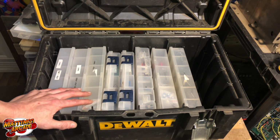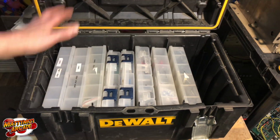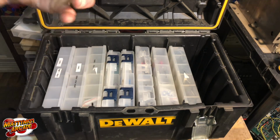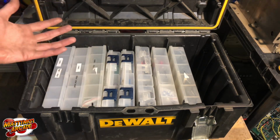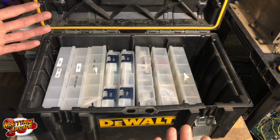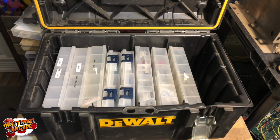All these boards have been like, oh, I don't know, or I wonder. There's no more wondering, really. I have almost everything I need to test everything within an arcade game some way or another. And if I don't have anything to test something individually, like RAM, I have a way around: we can put it in another board that works and fire the board up. Even if it's deductive reasoning, this works and this works. Those two working means that the thing next in line has to work, or it's at least getting its proper voltages. So you can narrow things down by deduction too.